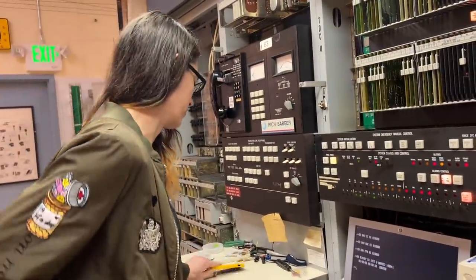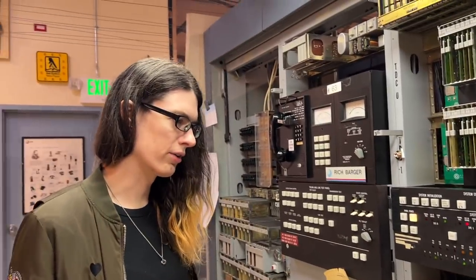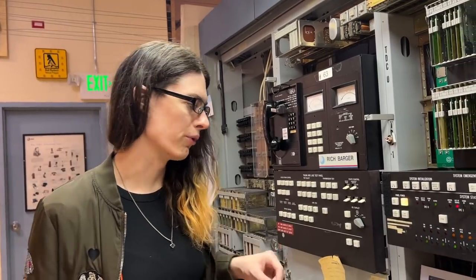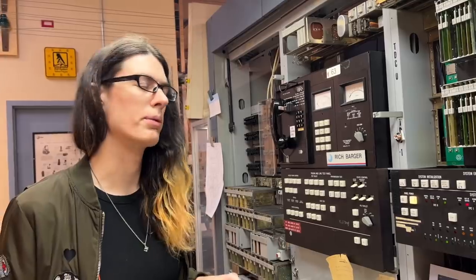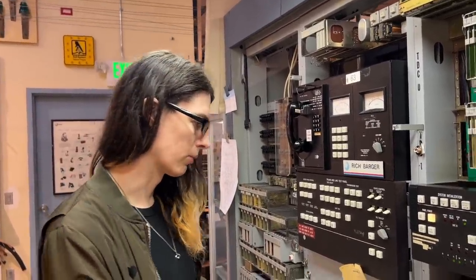It has a lot of complaints every time. We have to then re-initialize it — not the same kind of initialize. We need to bring the second processor up into a serviceable state, reload its memory, and inform it that all of its hardware does actually work, because it comes up in a state where everything is broken at base. Okay, so we're up.